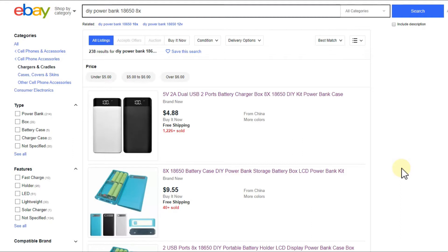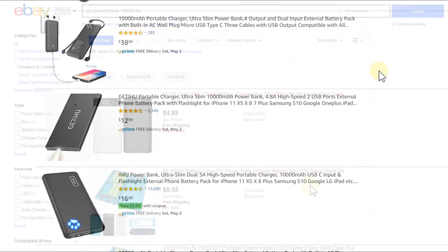The first reason is that when power banks die, in 99% of all cases it's not the case that's damaged but only the battery, because batteries have a certain lifespan. When you've charged them maybe 500 or 1000 times, or overheated them, they die fast. So you don't want to spend money on a new case — just new batteries.